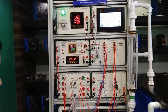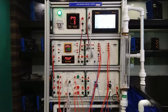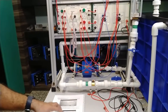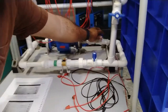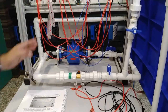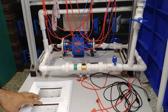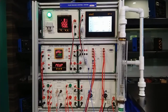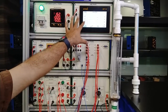For Part B of this experiment — measurement of flow by electromagnetic flow sensor (sensor 2) — we use the flow transmitter sensor. We just need to close valve 1 and open valve 3, so the maximum water flow will happen through the electromagnetic flow sensor. The readings will be taken and the output will be shown on the HMI as well from sensor 2. We will start the process again.